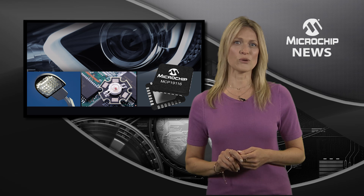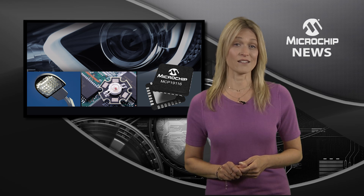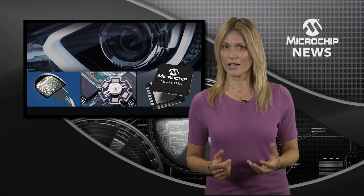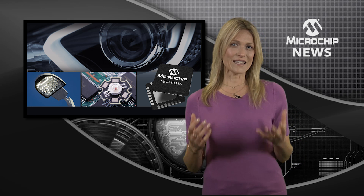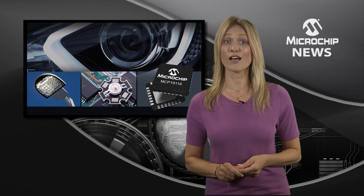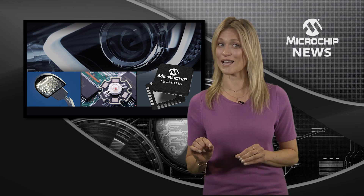The PIC-MCU core then adds an integrated A-to-D converter and an I2C communications interface for remote monitoring and control, as well as for on-the-fly configuration. And these controllers are just so flexible, they can be configured for tight control of light output levels without compromising light quality or colour.